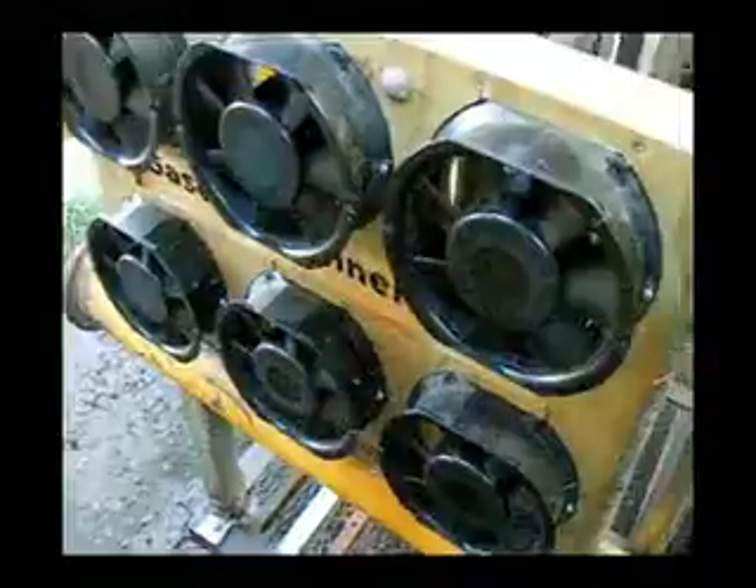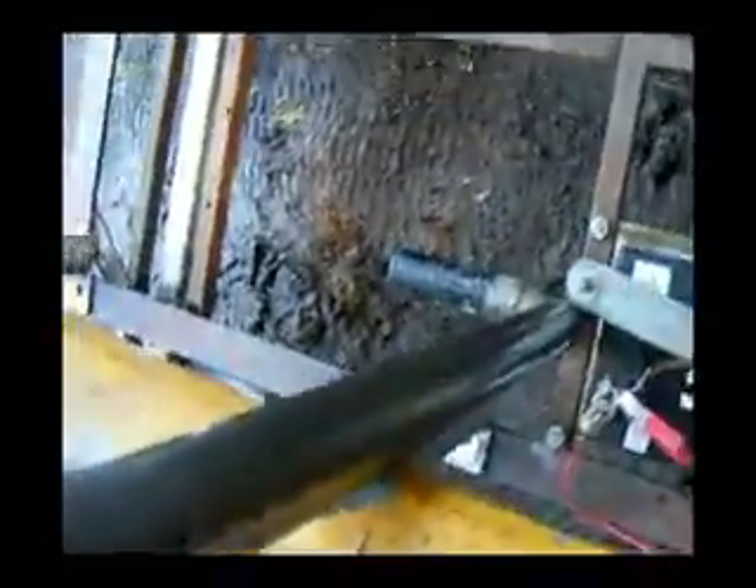The cyclone gas comes out of here and down to the bottom of the neighbouring tube, which is just hollow — the idea being to start the cooling process and begin evacuating moisture from the gas flow. The gas then comes around into the top of the radiator and is withdrawn at the bottom, where there's also another drain valve to let the moisture out. I've got a bunch of fans on here that produce quite a strong breeze, hoping they will cool these downpipes enough to produce cool enough gas for the job.